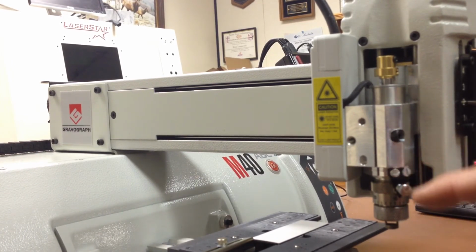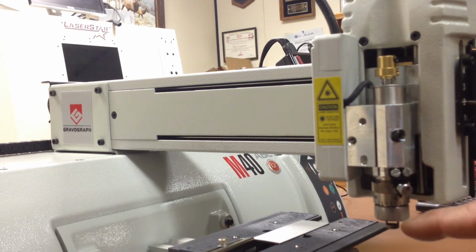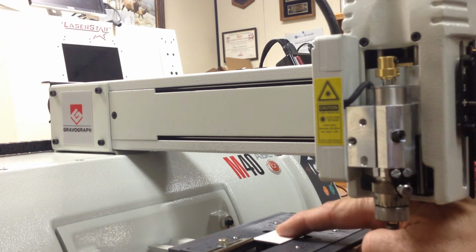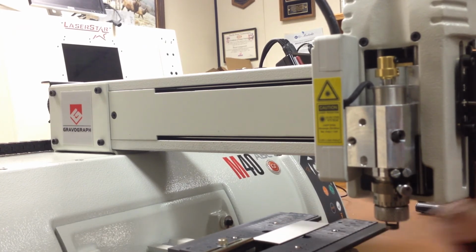we want it to work without having to make any changes here on the spindle. So when this dial is on 15, we want the cutout bit to cut almost all the way through this 1/16 inch plastic. Now if you look up on a decimal equivalent table, you'll find that 1/16 of an inch is 0.062, which is 62 thousandths. That's how thick the plastic is. So we want the cutting bit to be sticking out of the bottom of the nozzle about 60 thousandths.